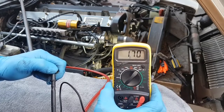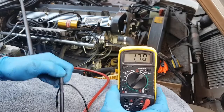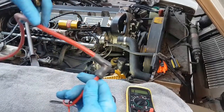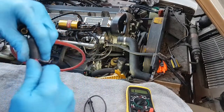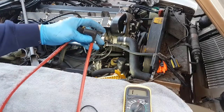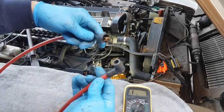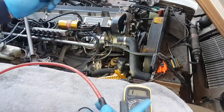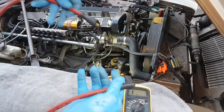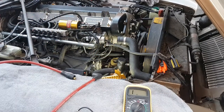There's a huge difference - that is truly colossal. It's virtually as close to zero resistance as it's almost possible to get. That is staggering, I honestly truly didn't expect it to be quite that low. The old one was around about 15 ohms and this new one is 1.7. Obviously shorter leads will give a slightly lower reading too - the longer the lead the more resistance - so that will have been the highest reading.